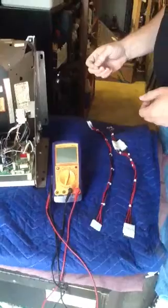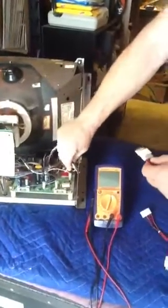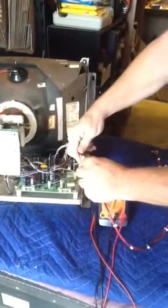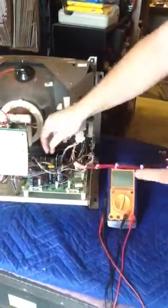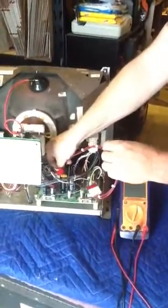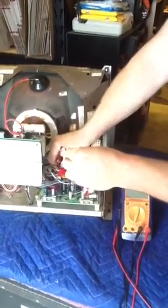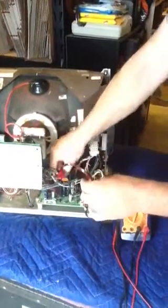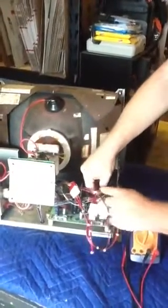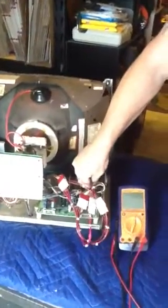So in order to do this, you're going to take one of the test cables, remove — on the 6100, this is the Y signal — plug it in, and go over and remove the X signal. This end will go to the X signal. Your next cable, you'll plug into the X signal. These are keyed so you can't screw it up. And plug into the — kind of hard to see with all the wires in the way — the Y signal.